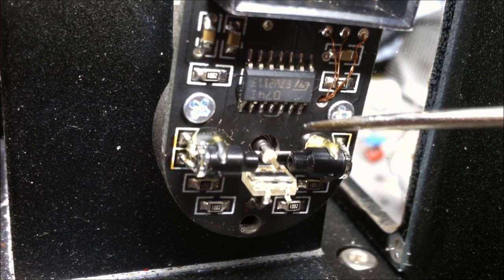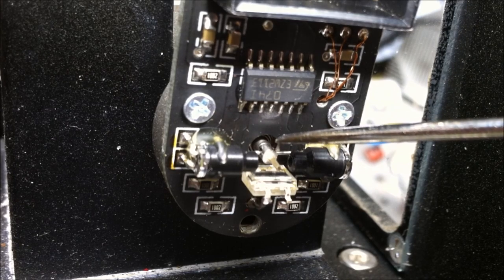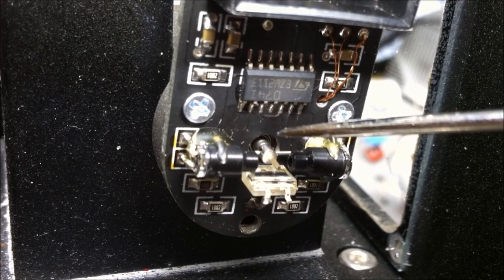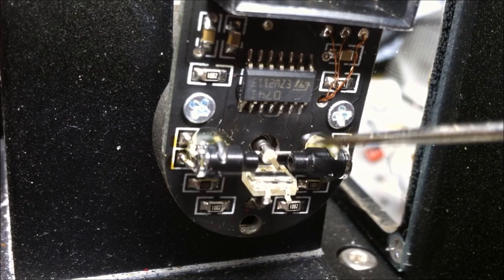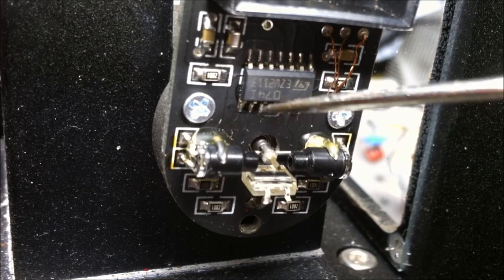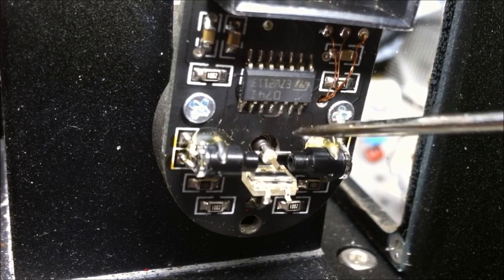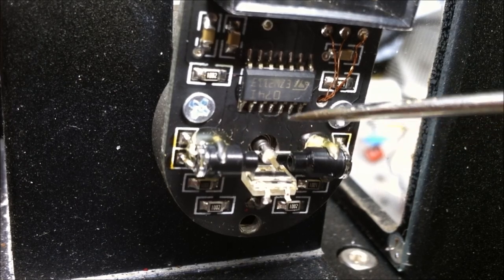So the construction, it looks like, is that there is a solid pin that goes through a hole that's drilled in the back of the Galvo stator. And the other one has such a kickback when it turns off that it just sheared that little pin right into two pieces. Now, I don't have a solid pin that's long enough. So what I want to try to do is put like a little piece of metal in there and make a rubber stopper and glue that on top of this area here. And hopefully that'll prevent the Galvo from over-traveling without that little over-travel stop pin in there.